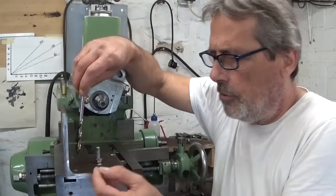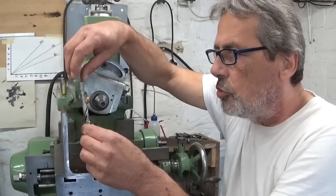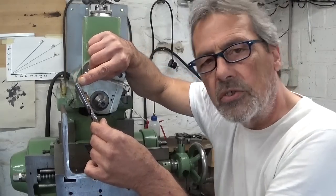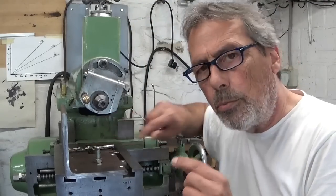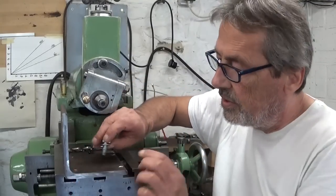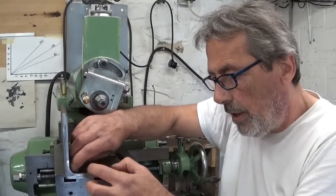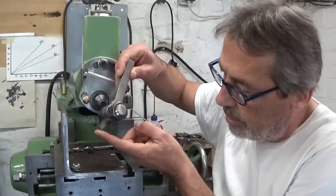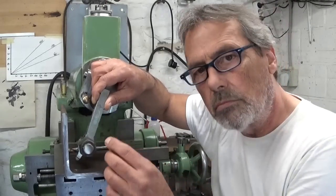Drilling the hole was in fact no big deal because my drill was a bit too short. I installed it in the chuck, just pinching here, and it left a little bit of score marks, but it worked. Now of course there's a new little problem, but it will be an easy fix. Because this hole is too close to this corner here. The little bolt doesn't want to fit completely in. So I'm gonna give it a touch with my round nose tool here and cut out a little bit more of this profile. And then it will work.